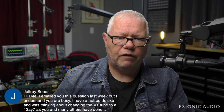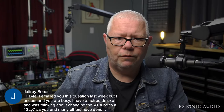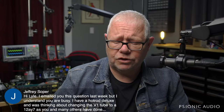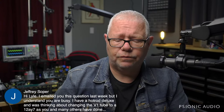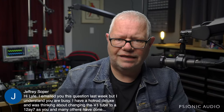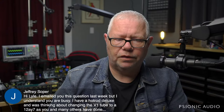Hey, Jeffrey Soper, sorry if I missed that. Yeah, if you've got a Hot Rod Deluxe, I've put this in videos. Change V1, I wouldn't do a 12AY7 for V1. You can. But actually, no, a 12AY7 makes sense in that. A 5751 would be my first try. But a 12AY7 there and then a 12AT7 in the phase inverter. That combination will give you a better sound.